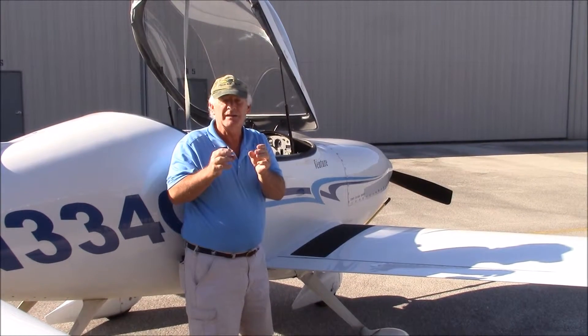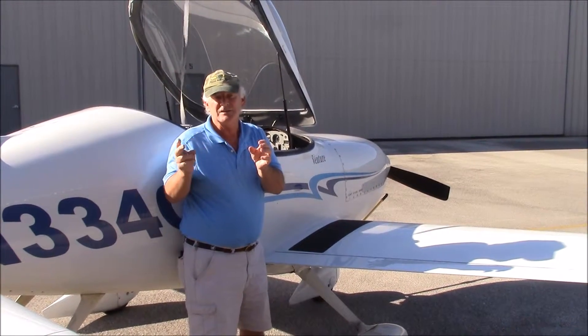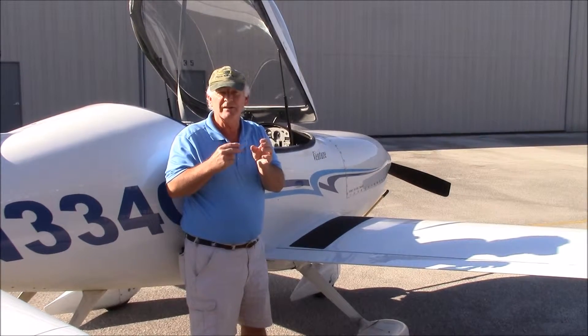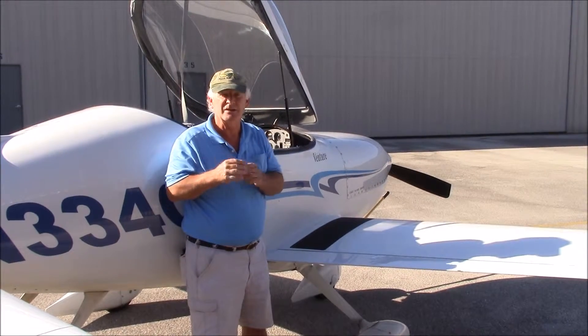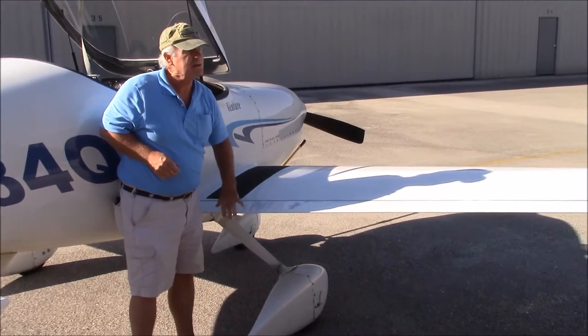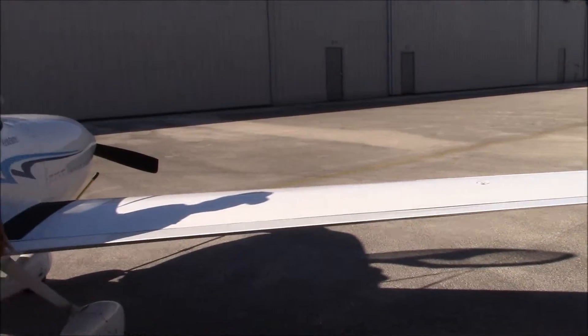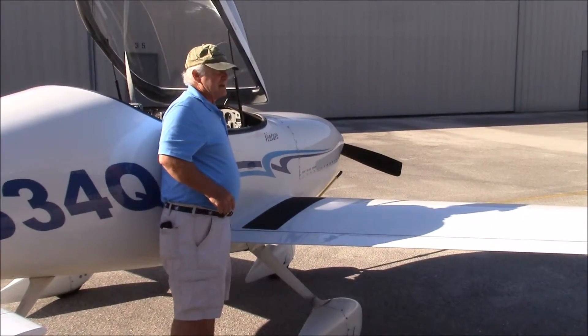They were having a lot of problems with those cams slipping enough, so I replaced all those with electric linear actuators. I took the sensors off those to be able to put inside the air moves — I can actually have a position indicator telling where it is. So if I move the aileron, you can see it spring loads back to the center. I'll move the aileron from inside and you'll see it move also.